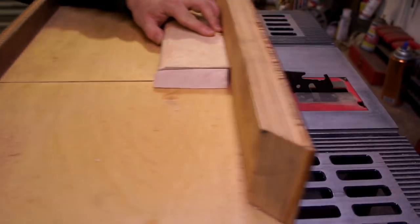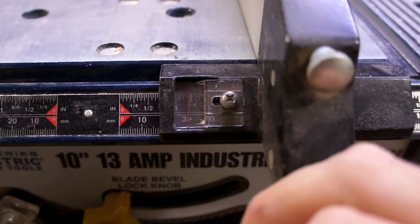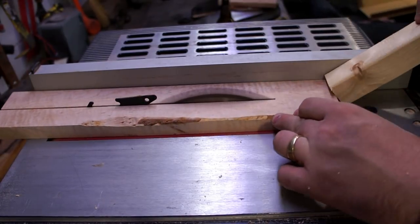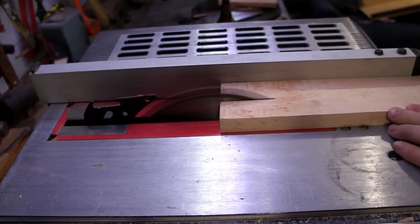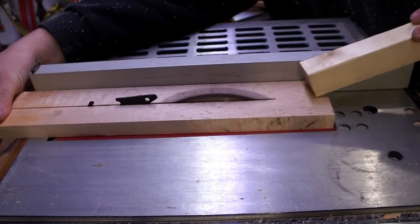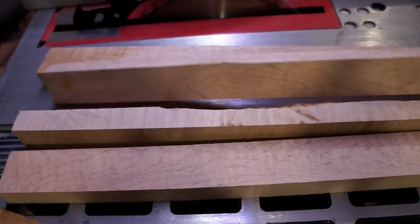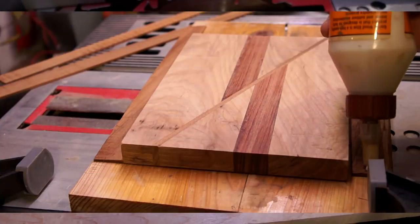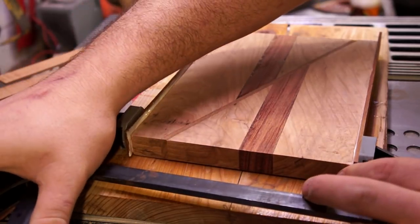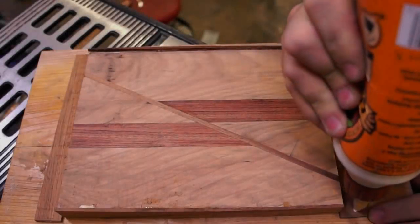For the perimeter I found this bird's eye maple that was at the right thickness. It had a little bit of routing on the edge from another project where it didn't quite work out, so I set it to the exact thickness I wanted and started ripping it down the table saw. All that texture on the edge isn't going to matter because I know I'm going to route over the edges and that will route out. When I'm buying lumber a lot of times I gravitate towards stuff that's a little bit rougher — when there's tearout like that you kind of get some cool variations in the grain. I like that in the finished product; I don't like it to look super uniform.